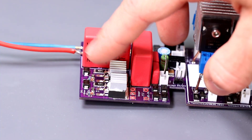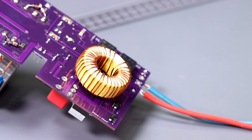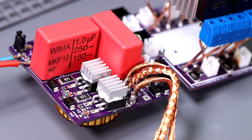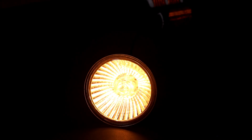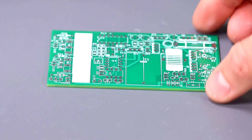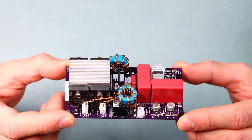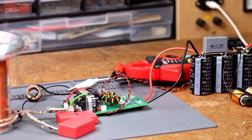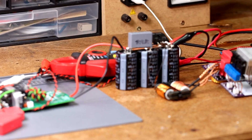I still want to offer you something in this video, so I will show you first that at least something works — the ZVS driver. I had to increase the inductance by a little bit. The connections of the transformer are simply soldered to the PCB. A 330 volt lamp lights up. Now we will do some tests with the old Tesla gun PCB in combination with the new one, because without flashes I won't finish this video. This is how the whole setup looks now — a bit confusing, but it works.